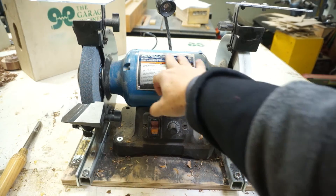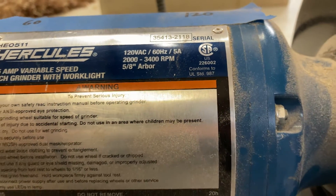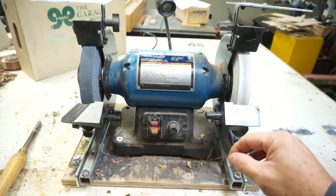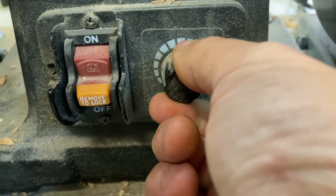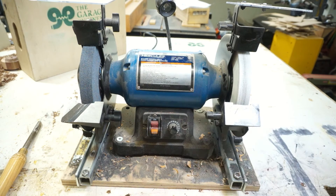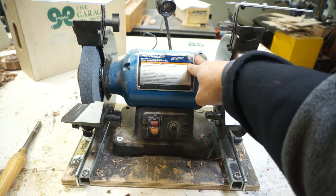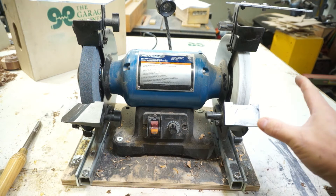At the current moment, this is my setup. This is a Harbor Freight Hercules brand HEO 511 grinder. It's 8 inch, 5 amps, variable speed — I'm assuming 5 amps is about 1 horsepower. It's big enough for what I need. It is variable speed, going from 2000 RPMs all the way up to 3400. When you're sharpening, you want it as low as possible. Most slow speed grinders go down to 1750, but I was willing to trade off since some low speed grinders cost a lot more. This was about $130 and I just set it all the way down to the low setting — it's worked perfectly fine.